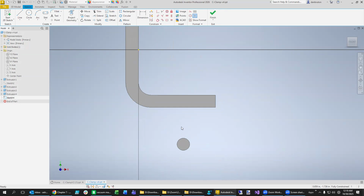Oh, okay. I didn't really see that for some reason. Okay, let's see if we can draw a line from center here. That seems to be easier to do. Why did it not lock in here? That's odd. So when that happens, I usually just try to get it to find the center. Worked a minute ago. So let's maybe project some geometry here. Let's go over to the sketch, project the geometry. Oh, I think I know why it's doing that. Okay, we'll do that and that just so we can see it a little bit better. Let's go back to the slot. And that worked much better. And we're going to have it go all the way up here to the top. That way it's just an easy lock-in.